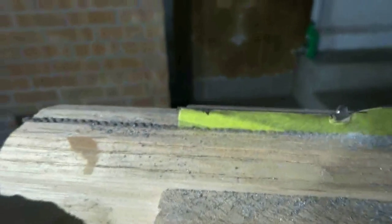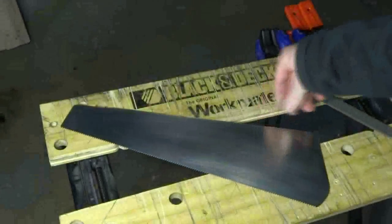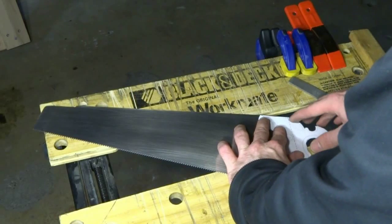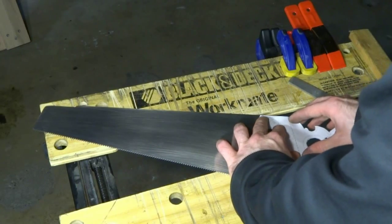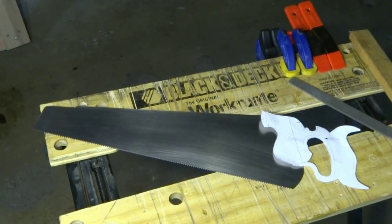All right, I think that's a nib I can live with. Last thing — I'm just going to round this front corner a little bit, and then I think we'll call it good and take the tape off. Well, there you have it. I think that actually turned out pretty good — for a first attempt anyway, that's something I can live with. Just laying the template out here, lining it up — you have a dotted line on the template that helps you line up where the end of the plate would be, and that's how far into the tote you'll cut. I think that'll make a pretty decent little saw. Thanks for checking it out, and I will see you next time. Bye-bye.